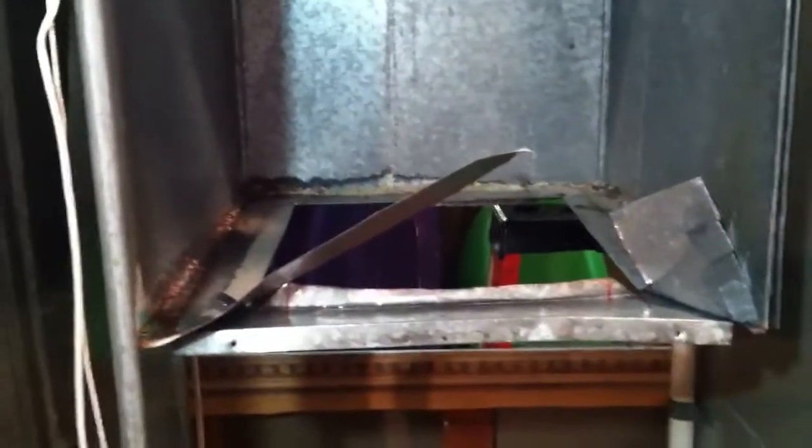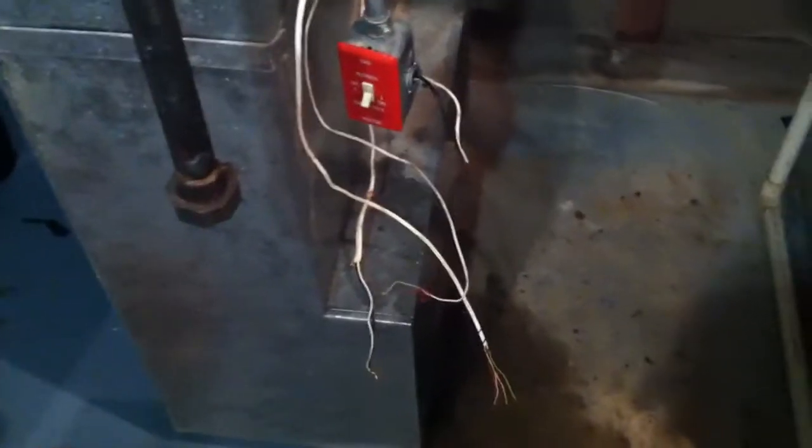Today I'm doing the first floor unit. That's the second floor, this is the first floor. So I got it ripped out, just gotta cut this back. Gonna have a little tight spot here. The existing plenum is 18 inches — see the boot there. The new furnace is 21 inches wide, and with the blocks it's about 69 inches high. So got some sheet metal going on. I'll show you guys what it looks like when I get it done.